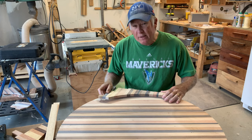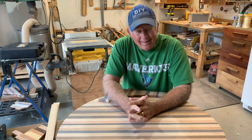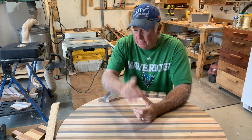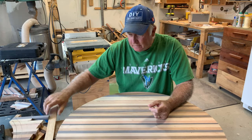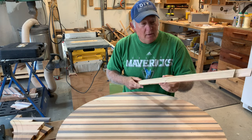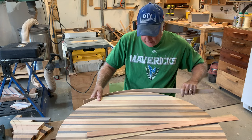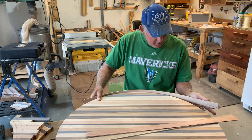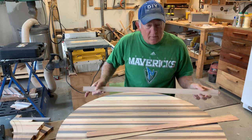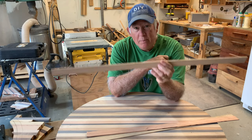But there are too many pieces that we'd have to piece together and the angles would be challenging. With some of the small pieces only being a half inch wide, the router bit might knock them off — so that didn't sound too good. Plan B is where we're going now. I'm going to take three strips of wood — three different species — and do an edge banding, wrapping it around the perimeter. You can see that it's pretty tight, so rather than force this, I'm going to soak it and pre-bend it.